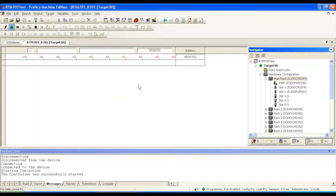Now, follow my arrow here — you'll start to see these figures appear in these different reference addresses: plus 1, plus 1, plus 2, plus 0, plus 129. You can see that it takes time to go through these different configurations. I'm going to shut off my processor briefly and turn it back on so you can see that one more time. This is what it looks like when an RTM705 passes through the processor. This is a pass-fail situation — this is a pass. When I have these figures arrive: %R00704 plus 1, R00703 plus 2, R00702 plus 0, and finally R00701 plus 129 — that's the final figure we arrive at if this is a good working device.